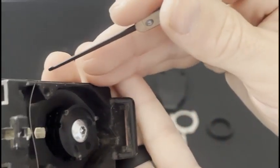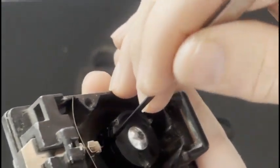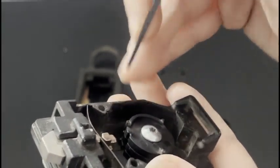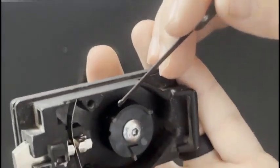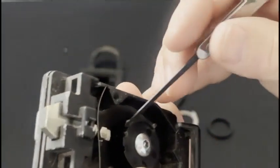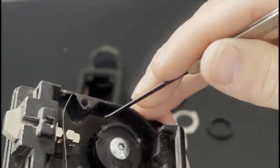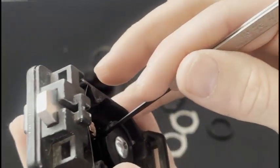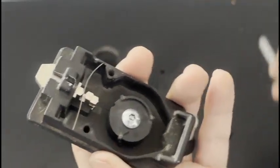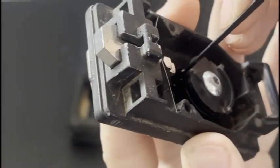The two wheels in the back spin a little freer than the first one. By putting this pick in, you can see the valleys have all aligned — all three notches are aligned, which is important. Make sure you don't just align the notch itself, because aligning only the outer notch without the valley will cause an issue. You have to make sure the valley is in line. For the video, I'm going to align these three notches to the top to make this simpler.